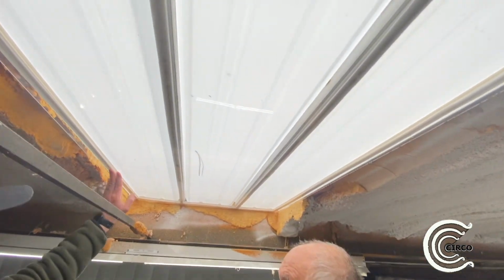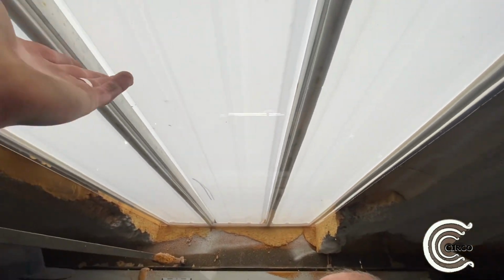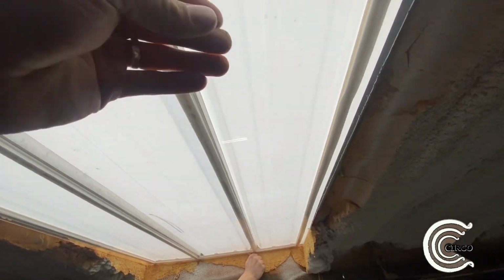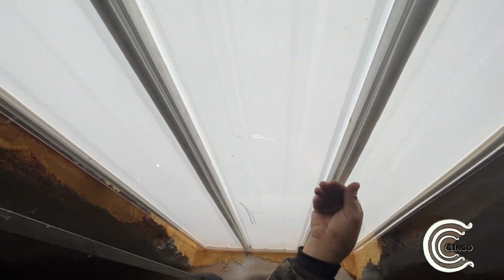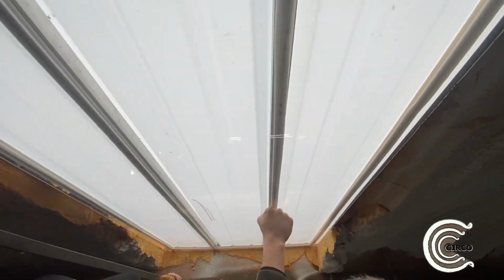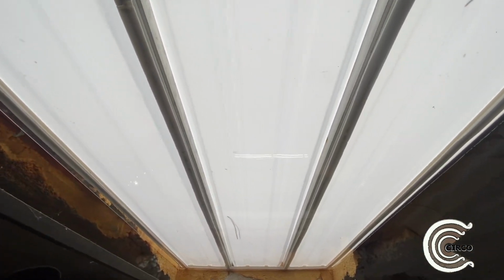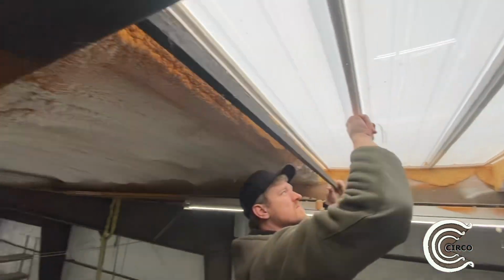All right, I'm gonna make sure it's fully snug against the strips there. No gaps that were not pushed and tightened. It's completely dry, so we shouldn't have any issue with it adhering to the sheet. Now both sides are done. When it rains and gets really cold, we're gonna see how these things did. See if they cut down the condensation and the dripping water into the warehouse.